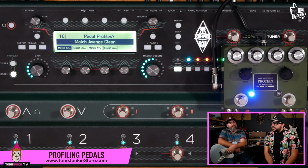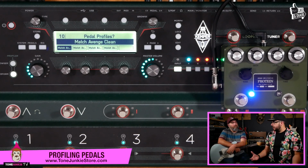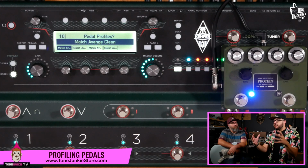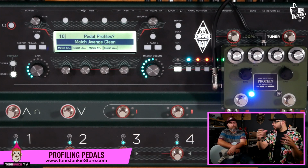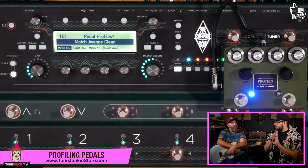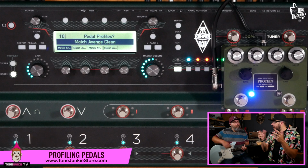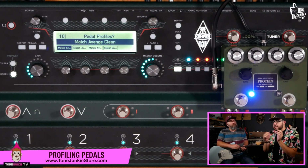If we think about why that might be, the Kemper is really designed to capture amplifiers. In an amplifier, there are multiple levels of compression and multiple gain stages. You have amps that break up at the preamp, on the first tube, on the second side of that first tube, then another, two gain stages just in a 12AX7. Then you can cascade tubes for higher gain. You have compression and breakup happening in all those places.